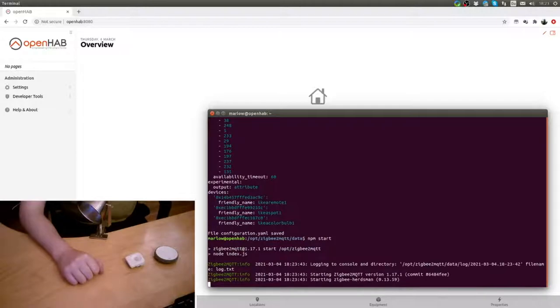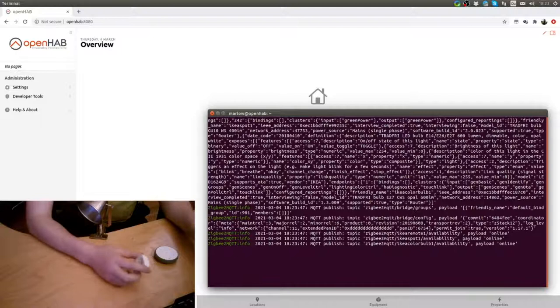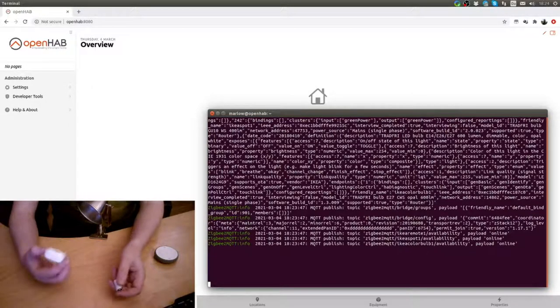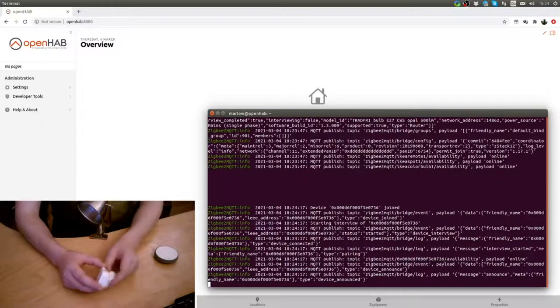And the trick with these motion sensors is that, once this is all started up, everything is there, the battery has to be out. They have these little CR2 cells. There's a little button here on the side. Hold that in for 4 seconds: 21, 22, 23, 24. Then you put the battery in and release the button within a second. It blinks blue, which means it's connecting, and then it goes green. As you can see, it has already talked to our zigbee2mqtt implementation.